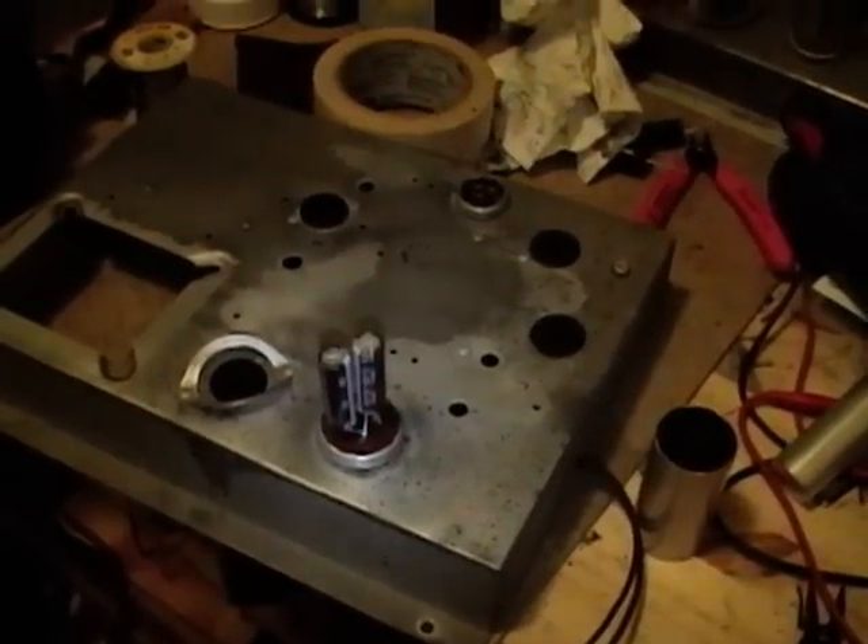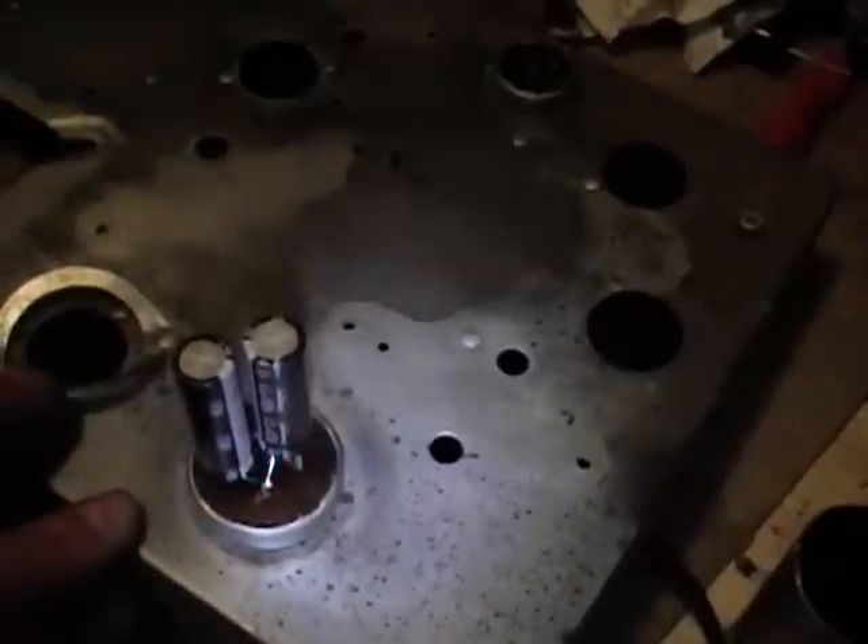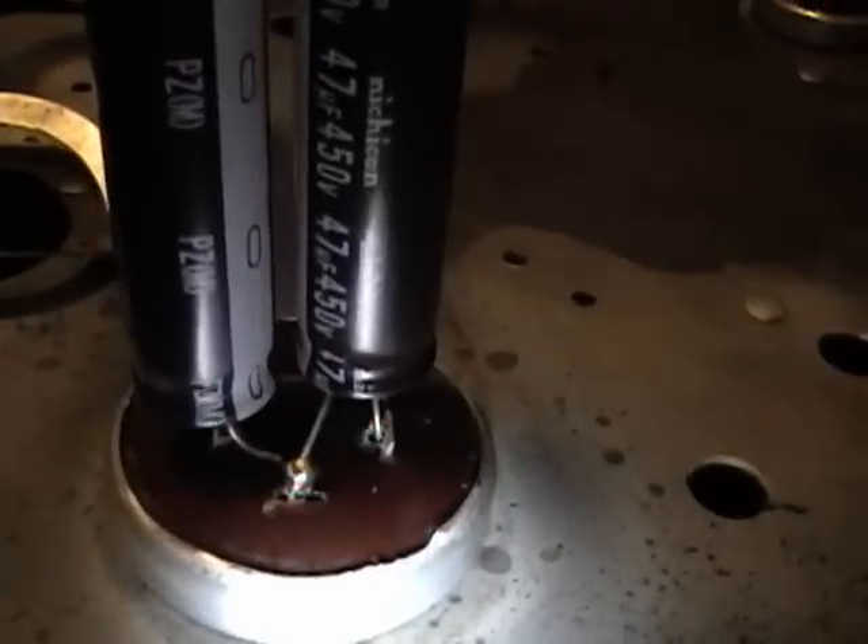Here's one I haven't recapped yet — you can see the three holes for the three capacitor leads and the one hole for the common lead. And here's one where I already put the two new capacitors in place, soldered the common ground together, and fed it through. Down below, you'd hardly know anything happened. On each red and blue wire, there's a new capacitor lead fed through from below, wrapped around and soldered on. And here's the ground lead where I used a bit of copper braid to ground the chassis.